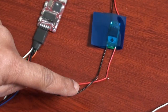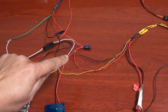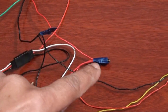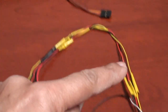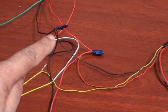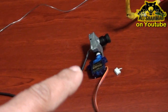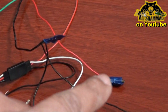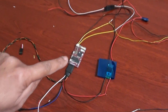Red and black power cables go to the OSD, and they are sharing the power here. You can see black and red at the same time — this black and red going all the way to the video transmitter, and from this port black and red also going to the camera. So black and red are shared with the camera, video transmitter, and OSD.